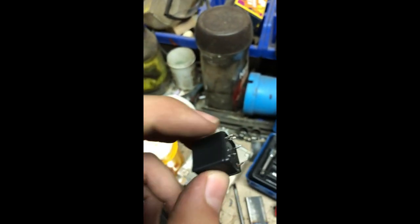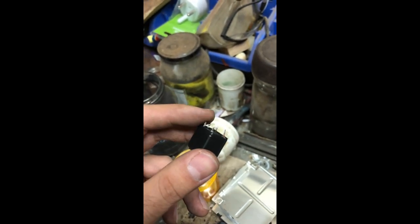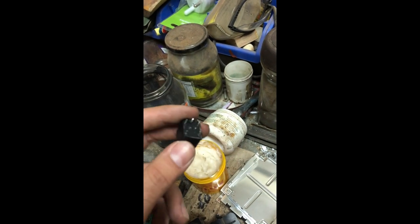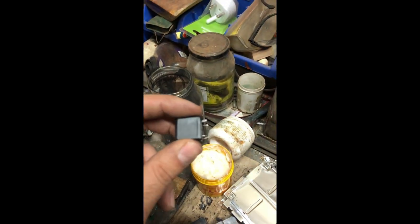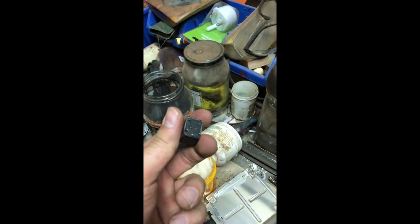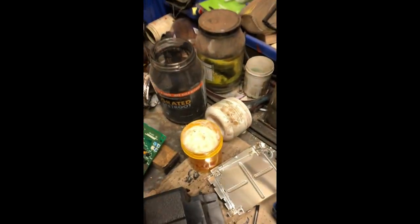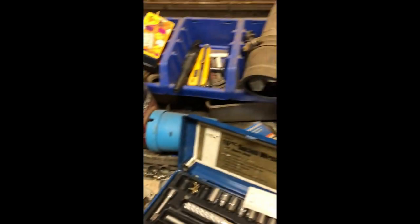Basically what I've done is cut it open. Inside, all five pins have copper circuit traces that are soldered together at certain points. What happened is I added some flux and re-soldered those joints, because apparently they were crappy joints that became dry joints and lost connection. The next step is to clean out the holes where it goes in, apply some flux, remove any old solder from those holes, then place it back in and re-solder it together.